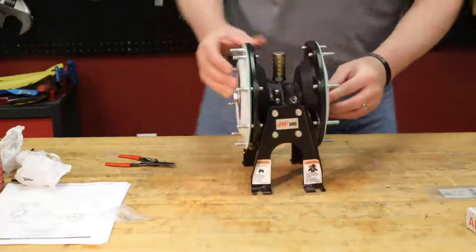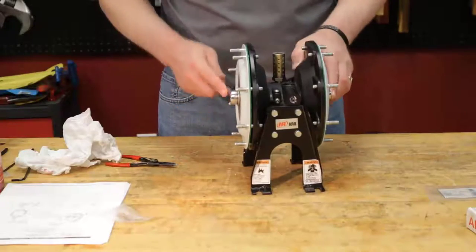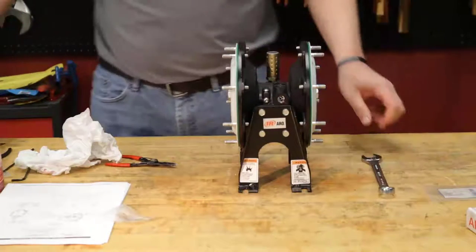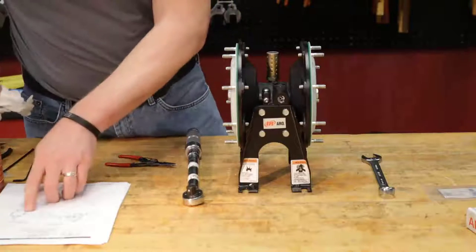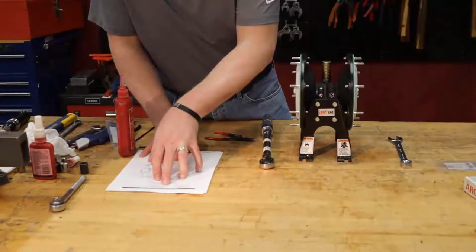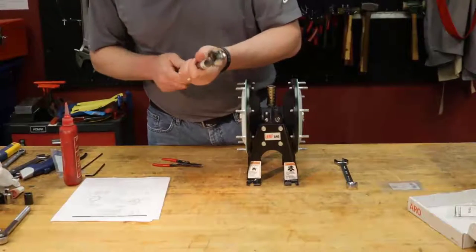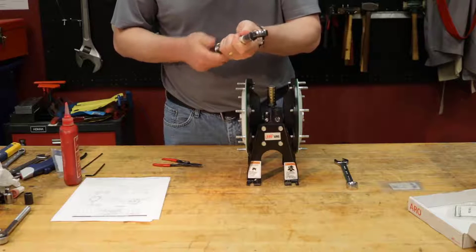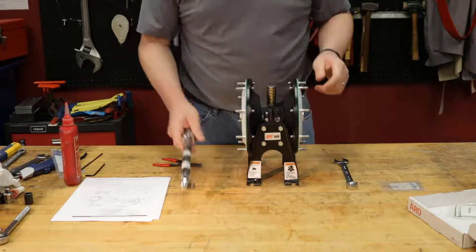Now, you can go ahead and take your 3/4 inch wrenches, and we're going to tighten these snug before we torque. We're going to check torque specs in our operator's manual. Let's see. We're going to look for our diaphragm nut. Item 14 tells us 25 to 30 foot-pounds. We're going to take our torque wrench, which reads in foot-pounds, and set between 25 and 30. Here we go, 30. We're set to 30. I'm going to go to the high end there.